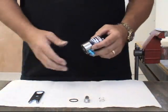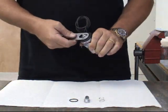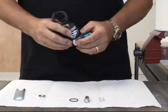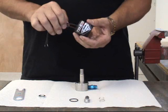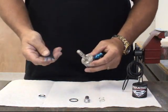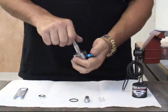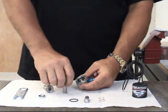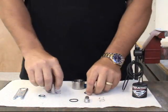We've got a nitrous solenoid here that we're going to replace the plunger in. The first thing you want to do is take your wrench and loosen the stem nut on the top of the solenoid. You'll remove this so you can remove the coil cover and the coil that actuates the solenoid — this usually comes off as a one-piece unit, the steel cover as well as the coil inside. From there you've got the stem. Take your spanner wrench, put it on the solenoid stem, and it's going to come loose. Take the stem out of the solenoid, being careful because as you take this apart you can drop the plunger, the spring, or you have the o-ring inside the solenoid that you're going to replace. Take your old three parts out.